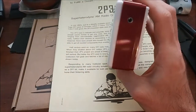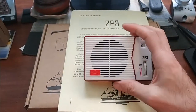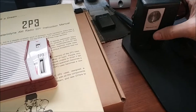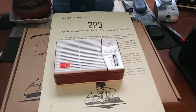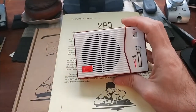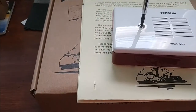It's really just a basic AM radio. You do get a headphone jack in dual mono, so you'll get mono out of both left and right speakers. It comes with a one-watt speaker for loud audio. The plastic case is actually quite thick and sturdy, and the overall weight is pretty good. The audio amplifier is based on a single IC with surrounding support components, while the rest is more old-school.